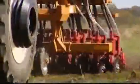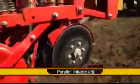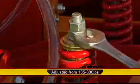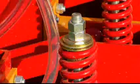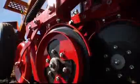The HayBuster delivers on many levels of quality and efficiency. Accurate seed depth, for example, on these drills is accomplished with heavy-duty cast parallel linkages and adjustable packer wheels on each opener. The opener has down pressure springs adjustable from 135 pounds to 300 pounds, so the drill can be adapted to any soil condition. Plus, depth bands are added for proper placement of the seed when the ground is too loose.